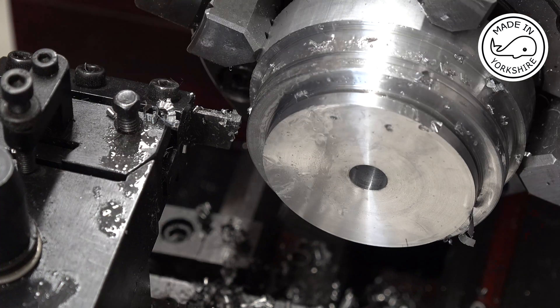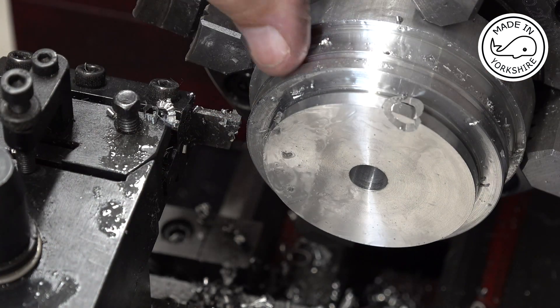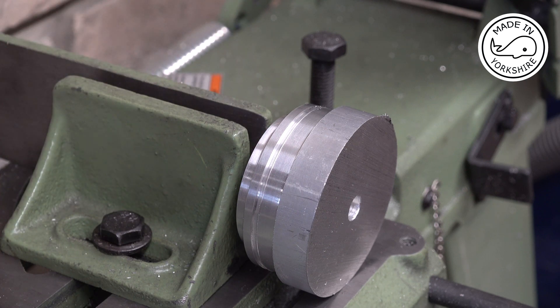Having marked it up I think I'm going to take it off the lathe and try and hacksaw it off. I've superglued a bit of bar stock into it and hopefully I'll be able to cut it off with the bandsaw.